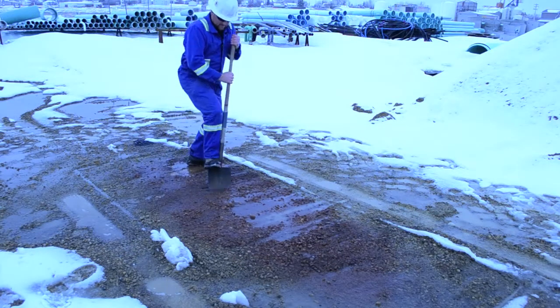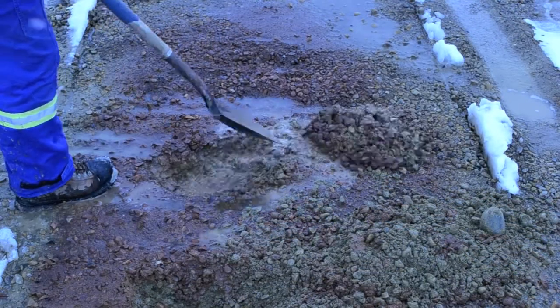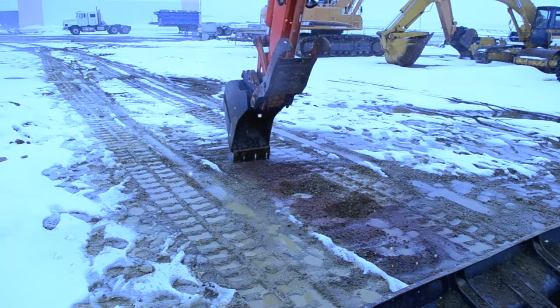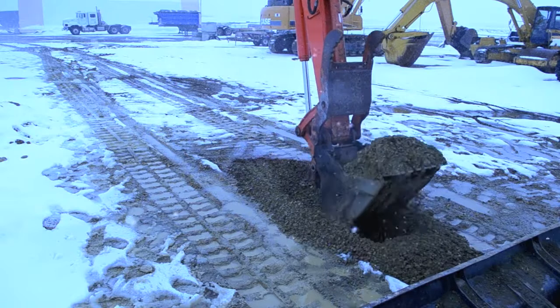The FROSTHOG will consume approximately 7 liters of propane per hour. Asphalt does not affect the frost removal process. By removing all the moisture, refreezing does not take place for an extended time should there be a delay in hand exposing. If soil is not disturbed, the thawing process will continue.